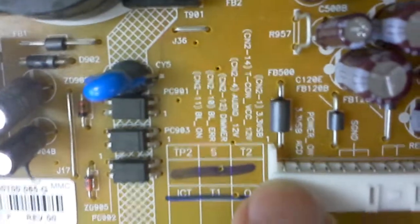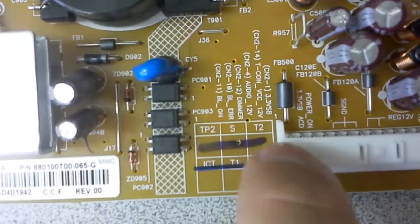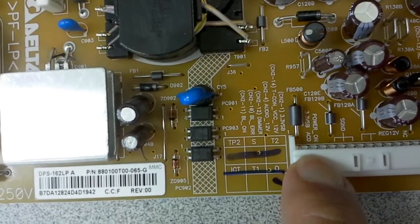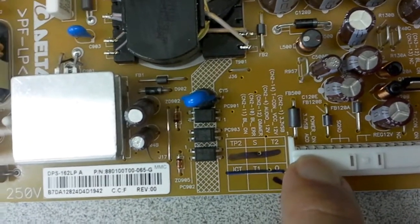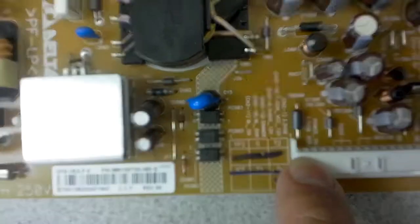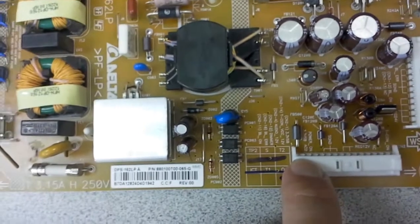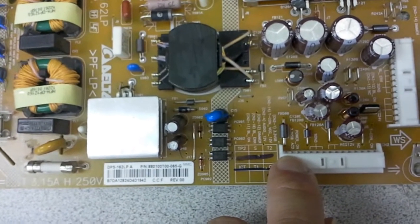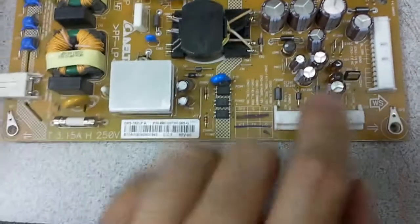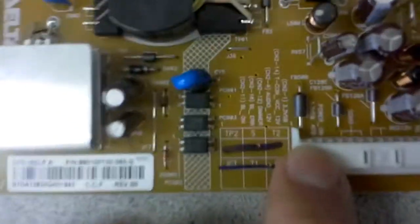You can see that the very first pin down here is 3.3 standby voltage. It's not written down there because there is not enough space, but you can see that right next to it is ACD — abbreviation for AC detect. This pin gets a logical high, that is anywhere between 2.6 and 5 volts — in this case if the standby is 3.3 then my guess is it will be anywhere between 2.6 and 3.3 — when the board detects that it is connected to AC power and AC power is present. This is needed for the main board of the TV to shut off in case the power stops suddenly. The power board has enough energy stored in capacitors to do some urgent storing of data and prepare for emergency shutdown. This is the meaning of the ACD pin.